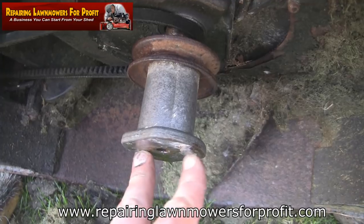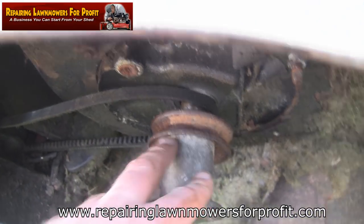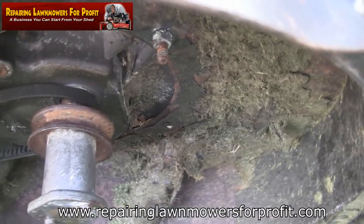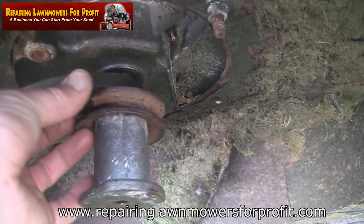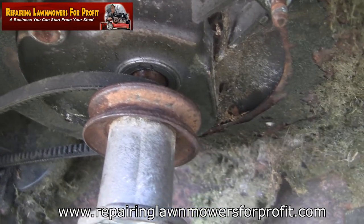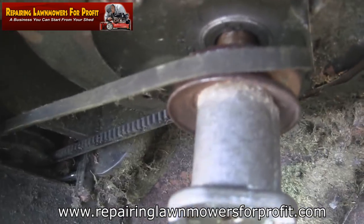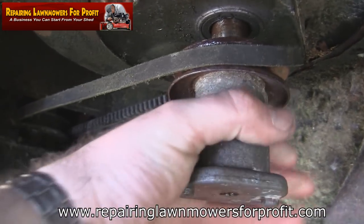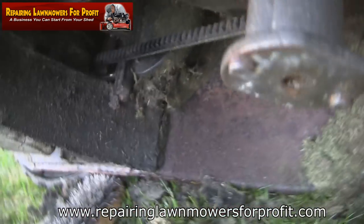If you do tap it up and it's a bit stiff, make sure you don't knock these pins off. Sometimes it can be quite stiff getting them on. I'll just get a bit of wire wool and clean this shaft off here and clean the inside of this new blade adapter. I'm going to pull this on with the belt underneath - I'm going to put the belt on and turn this whole thing with the belt. You can see how I've half got the belt on there, and make sure it's still attached to this drive at the back. All you want to do before you get right to the top is just turn it - the whole thing will just grumble a bit - and then you've got your belt on.